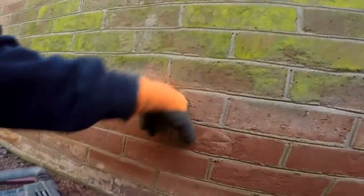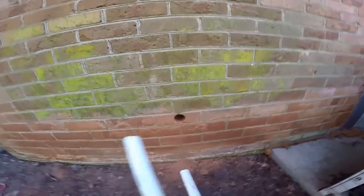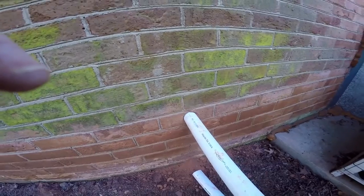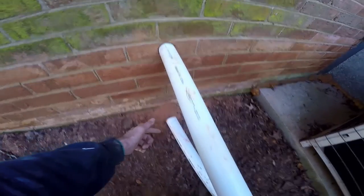We make real quick work of coring that brick. You can see we're all the way through - you can see Chuck in there digging. This is where we're going to put our inch and a half PVC. Great tool - Bosch hammer drill. You can rent this at any Home Depot or tool rental, about 40 bucks for four hours, and the diamond core bit is like nine bucks. With your core drilled through the foundation, here's your two inch hole - that is the exact outer diameter of our inch and a half pipe. We can slide this right through very easily.